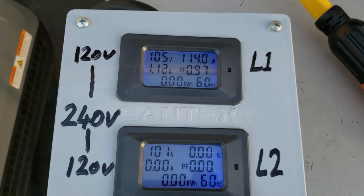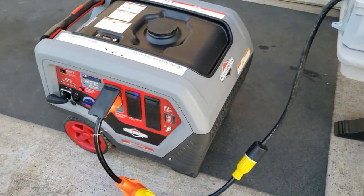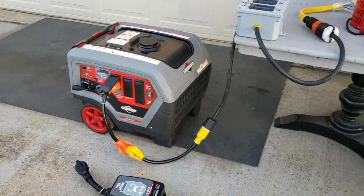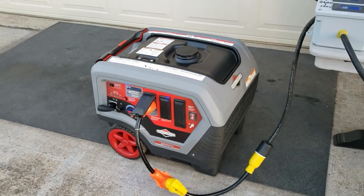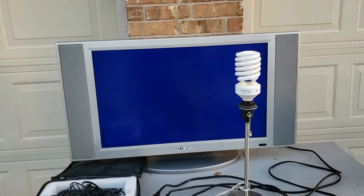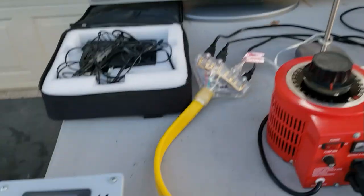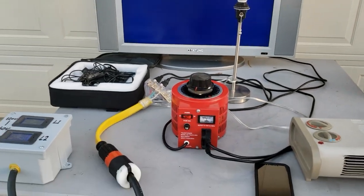Alright, we're on. The TV is coming on and it's running at 104 volts on leg one, 105 volts on leg two — not enough power to make the compressor surge up. Scott suggested adding a light bulb, so this one's for you, Scott. I'm keeping it in eco mode since gas prices are too high to have this thing screaming. TV is on at 104 volts; adding the light bulb — TV and light bulb still at 105 volts, 501W and 201W.